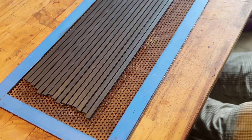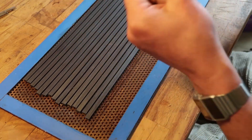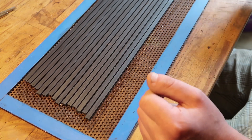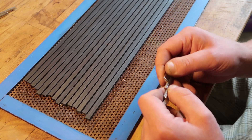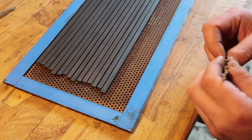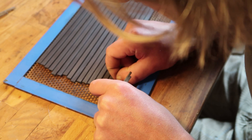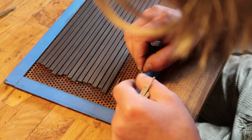For this part I'll use some neodymium reclaimed magnets — there's a reason for that. These are only 2 millimeters thick and the spacer is 4mm, so the reclaimed magnets that still have some crappy glue on them would not matter in this case. If I made a tweeter with very small spacing from mylar to magnet, the residue on these magnets could be a problem. Normally I clean them, which is not fun. In this case I can use them without cleaning, which is a joy. So magnet should be sitting here, and the next one will be here.